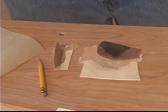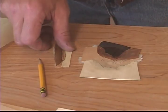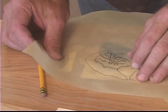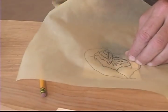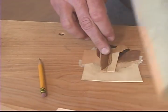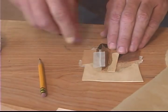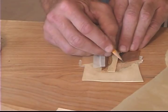Now I have to join the botanical part — I think it's called the stamen — to the parts that are already cut. I've made that up as a separate package with four pieces of wood joined together. To join these two parts together I'm going to go back to my tracing and key that in with the parts already cut. Then I slide this package under until it gets to the correct place, remove the tracing, and put a little masking tape on here to hold these parts in the right spot. Now I can cut around the perimeter of this part and that's going to join this package to this package.